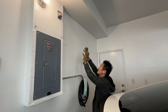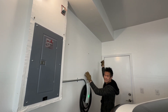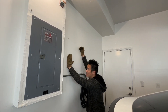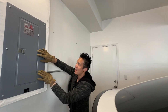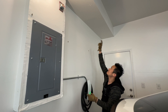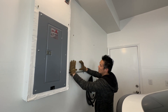If we do that, it'll be nice because we have the three batteries here, we'll put the EcoFlow power hub here, and the power hub will connect to the three batteries and eventually to the solar panels on our roof. Then we'll have the distribution panel right here, which is perfect because it can connect directly into our circuit breaker. We can also get power from the circuit breaker back to the power hub to charge it. So it's perfect — battery, battery, battery, power hub, and distribution block right there.